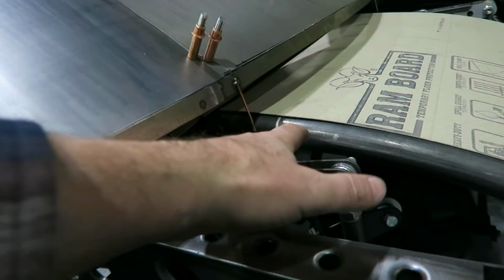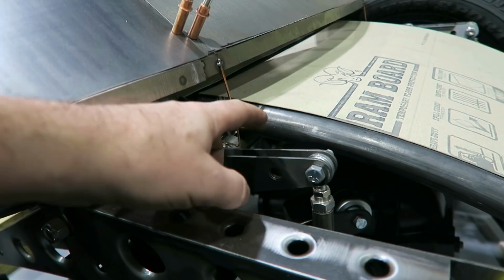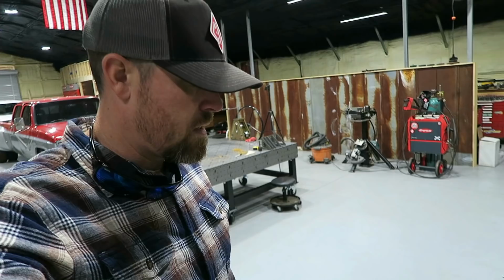And because it's gonna have a piece of sheet metal here, it'll be visible because I'm not going to continue it all the way over. I'm going to leave it notched out for this stuff here. It'll allow me to put some dimple dies in it, give it a little bit of character, make it look like it has some kind of structure behind there. So that's what I'm going to start working on right now, is that piece of sheet metal, get it broke over, go ahead and put those dimple dies in there, and then see what it looks like. I think it'll look good though.